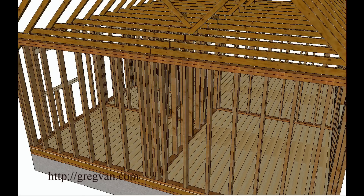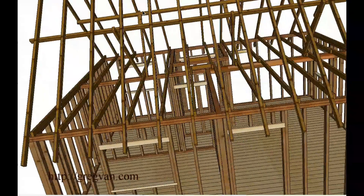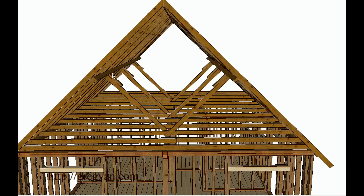I'm going to put a link at the end of the video. Now that you have a general understanding of roof purlins — how they work and what they're for — they are there to redistribute the load more evenly and to prevent the lumber from sagging. This was a real common method used years ago but it doesn't seem to be used as much today.